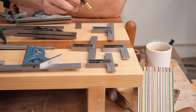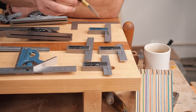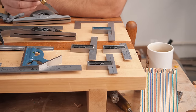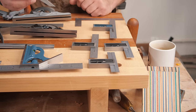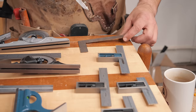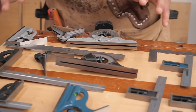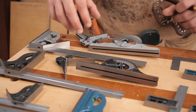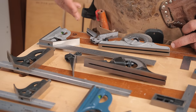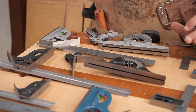What I like about T-squares is they are really accurate. PEC makes them to a 1.5 thou tolerance of squareness, whereas their 12-inch squares are 4 thou over 12 inches — very tight tolerances. That's the maximum allowance they'll allow. Here I have my Veritas layout square, which I use for laying out joinery. It's a square I love and is always in my vest. Over here we have a couple different kits. This is a blem kit from PEC, Precision Engineering Company — same as the Starrett kit. It comes with a compass, a center finder, and your standard combo square.